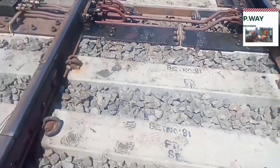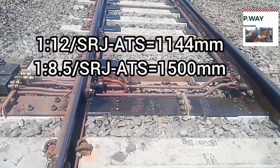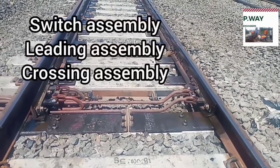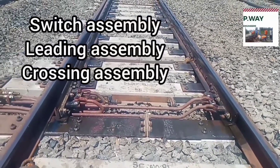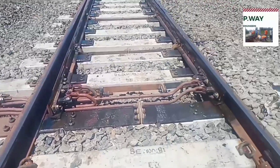The rail length between stock rail joint and actual toe of switch should be 1,144 mm. A turnout consists of 3 assemblies: first, switch assembly; second, lead assembly; and third, crossing assembly. First we can see the components of switch assembly.